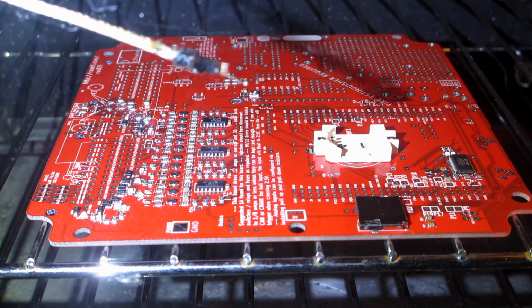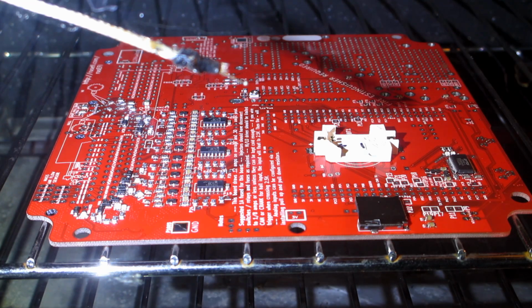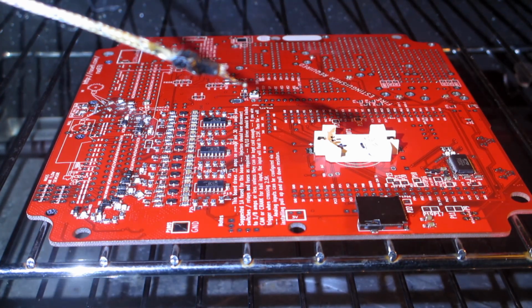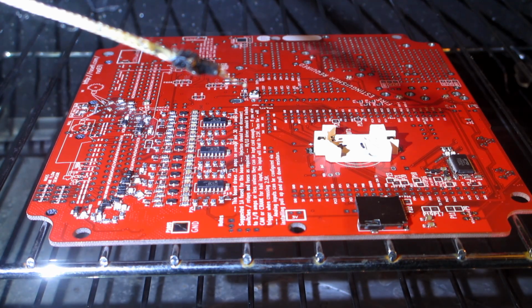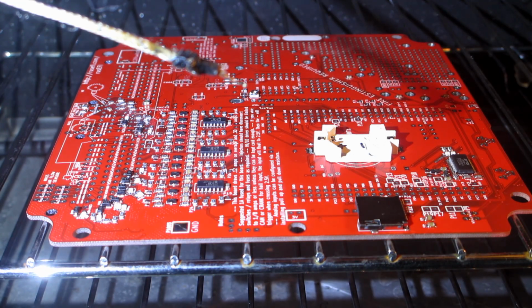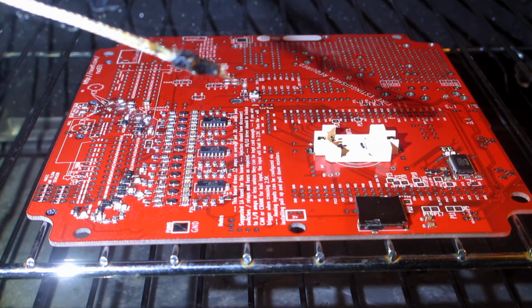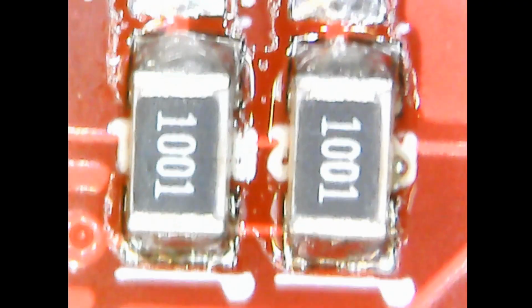It was a bit hard to see on the far side, but by 160 degrees Celsius it looked like it was all soldered. I left it till it hit 170 degrees Celsius because that was the temp in my tests that I'm sure the paste became solder. It took about 15 minutes from dead cold to solder. Then I gently cracked open the door and let it cool down till the solder was solid before I moved anything. Now for a visual inspection.